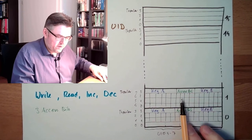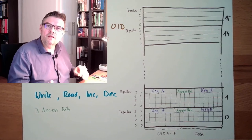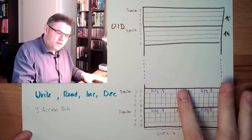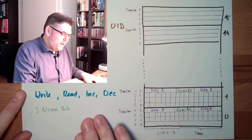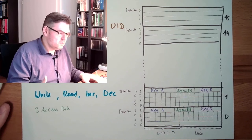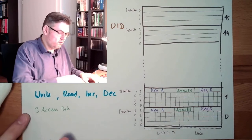Yeah, why are there 4 bytes? Yeah? Because they are stored in a special form. They are stored inverted. So there is a redundancy in there for the access bits. The pattern of the access bits. So with 3 bits, we have 2 raised by the power of 3. So 2, 4, 8 different combinations